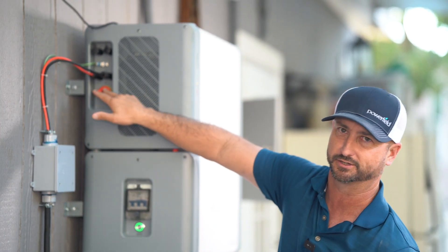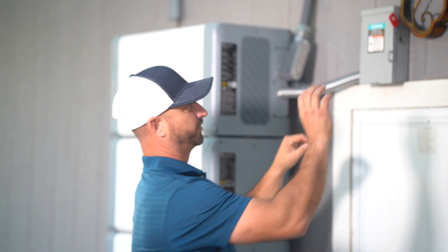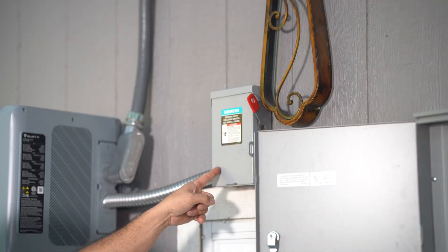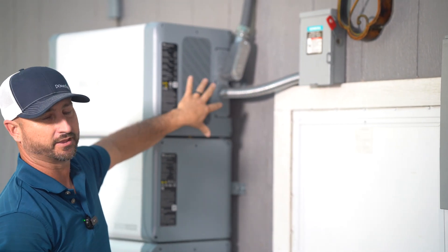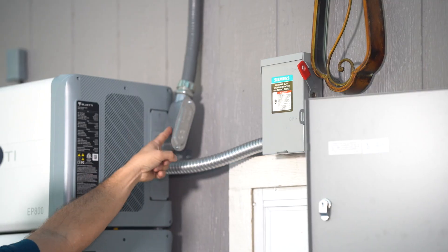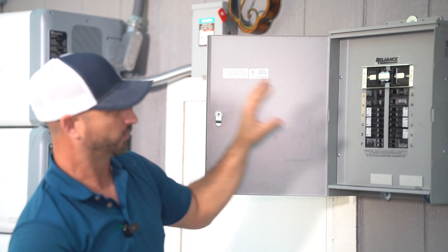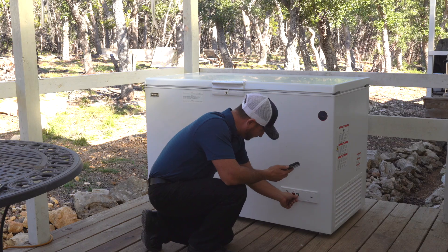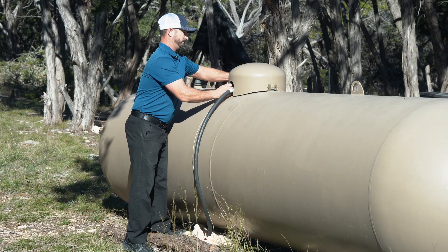We have a breaker up there to kill the power coming in, and also one here that kills power to the EP800. Grid power comes from the main panel on the other side of this wall, feeds this disconnect switch, and feeds the grid into the Bluetti as backup. From here it powers out, goes up high, and drops into this critical loads panel — so the EP800 is powering all of these loads, which is basically 95% of the whole house since the large appliances are on propane.